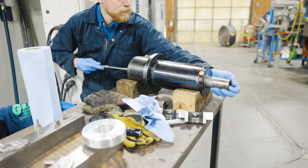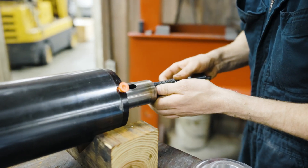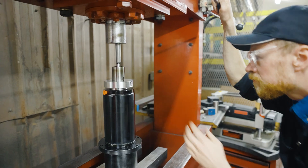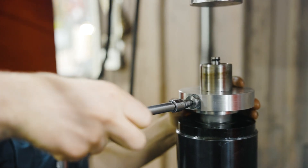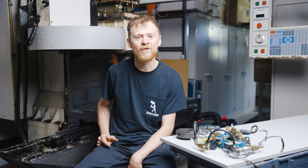After that, it's pretty easy. Put in some type of punch in the bottom of the spindle and push out the drawbar. To reassemble, put the drawbar inside the spindle, slide the drawbar ring over the end of the spindle shaft, and install the drawbar bolts inside of the drawbar ring and drawbar. Then heat up the spindle coupling to about 400 degrees and drop it onto the spindle shaft. Some spindles have a shoulder; others you'll need to measure a spacer, put in a spacer, and drop the hot coupling onto the spindle.